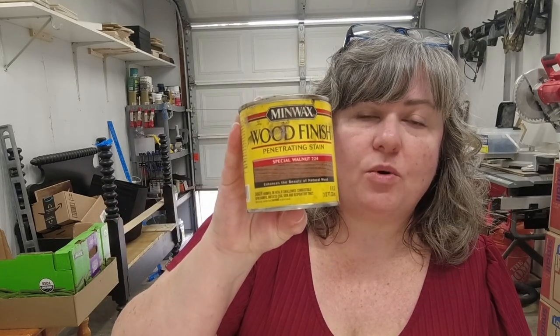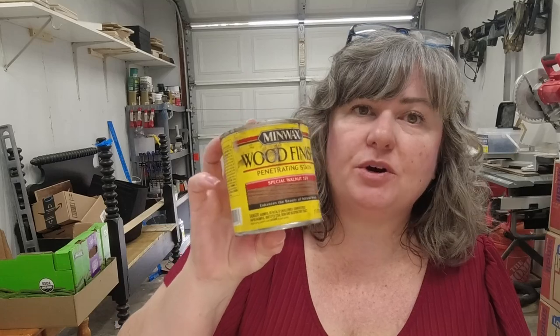So we are going to use that piece of wood that we prepared together, and we're going to do our first art piece together. I'm excited. What you need is some oil-based wood stain, and you want to make sure you're using oil-based because we preconditioned our wood for oil-based stain. There's a big difference. You don't want to use water-based stain if you used oil-based preconditioner.